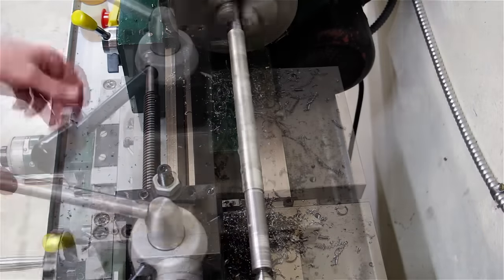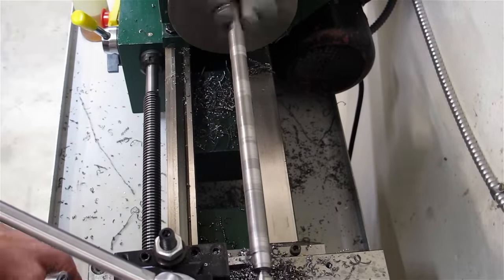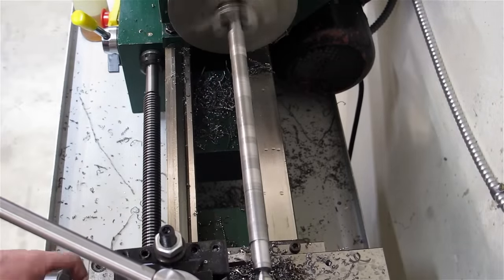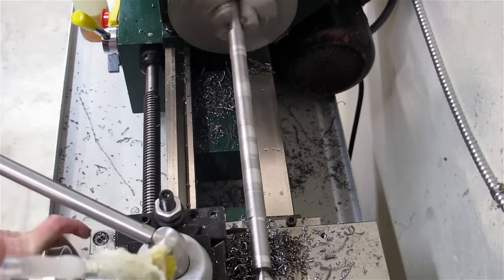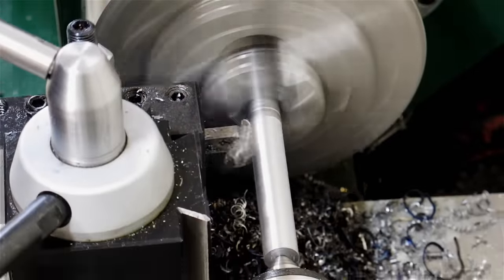I have a die holder for the lathe on the project list. Holding dies the way I've been doing is not the best setup. I do like using dies over single point threading because it's a lot quicker. If I have a die, I use it. I single point threads when the dies are exceptionally expensive or absolute precision is required.